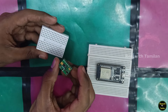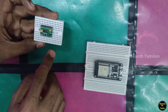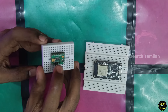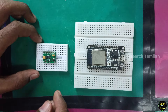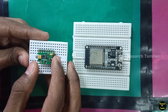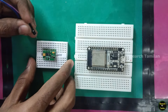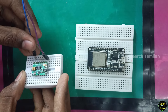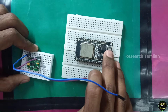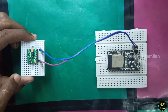This sensor is the MAX30100 sensor. I have a breadboard. I am going to insert it on top. For example, we can put a finger on the sensor. The first pin is VCC and the last pin is GND. We are going to insert jumper wires. If we have VCC on this sensor, we will connect 3.3V. The first pin is 3.3V and we will also have GND.